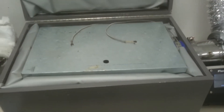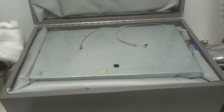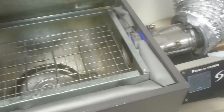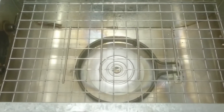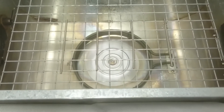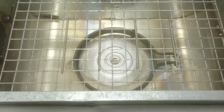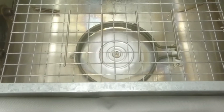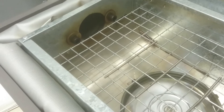At their core is a hardware store toolbox. You can see we've got two thermocouples in here. And if we look down inside, we see the guts — a heating element and fan from a fan-forced oven. To get the biggest, highest power element you can, you need a minimum of 2 kilowatts — I think that's about 2.3 kilowatts. You can get the fan on eBay; they're dirt cheap. We then cut some stainless steel to ramp up the sides to help the air.